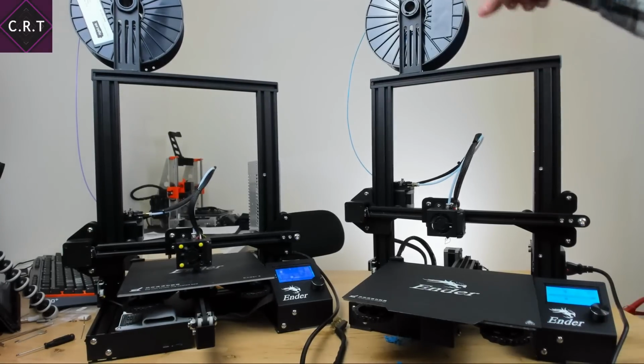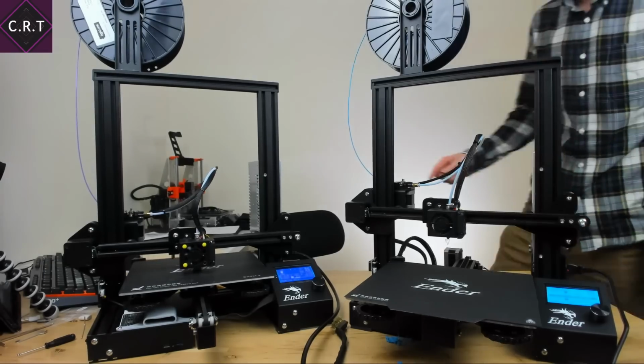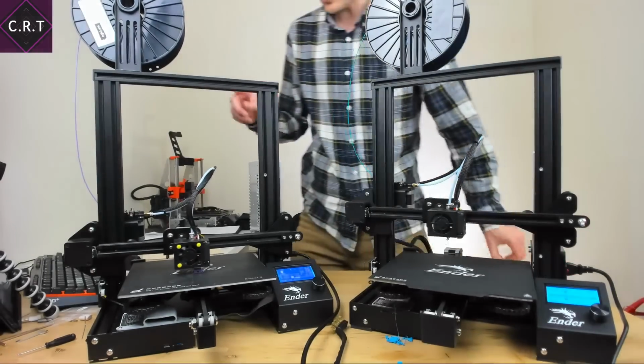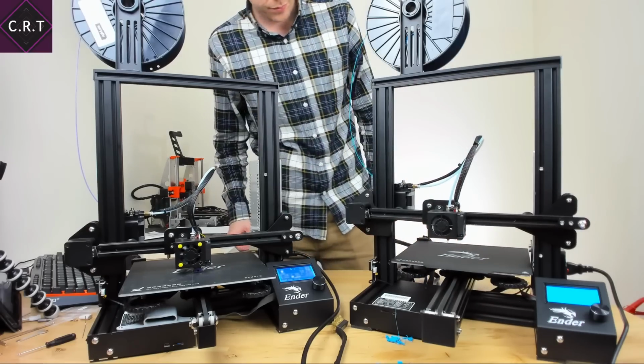When this starts, I'm going to change the temperature down a bit, please. I think the problem is the settings I had it for were not for the rigid ink PLA, which generally prints cooler than everything else. So.